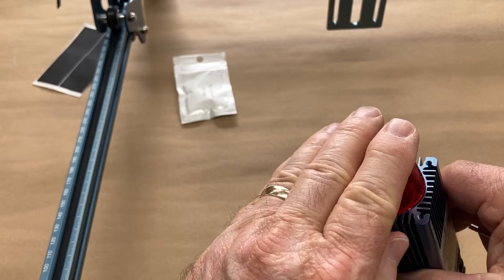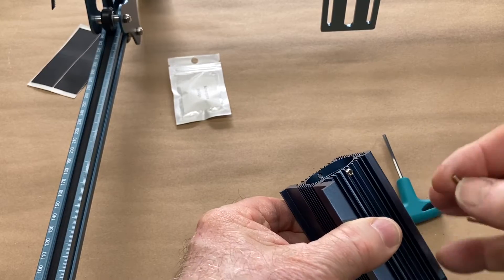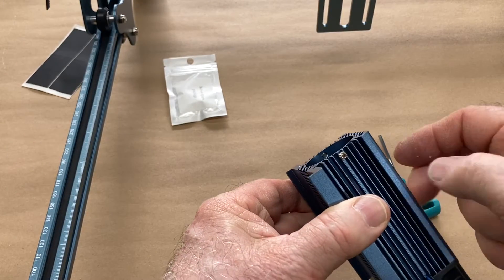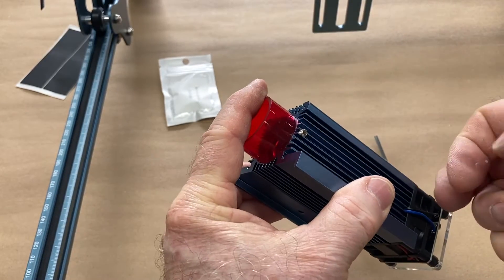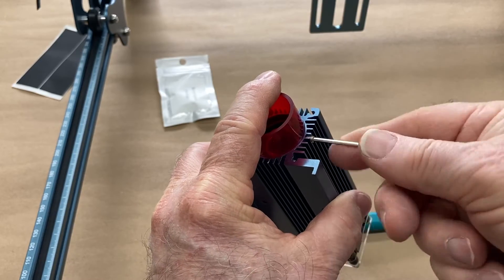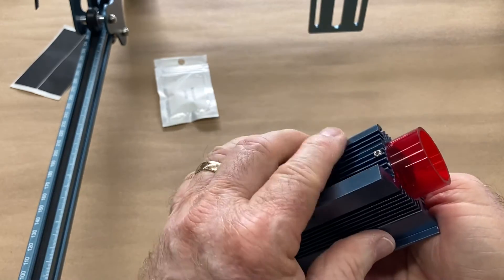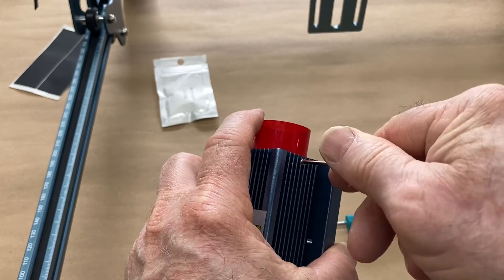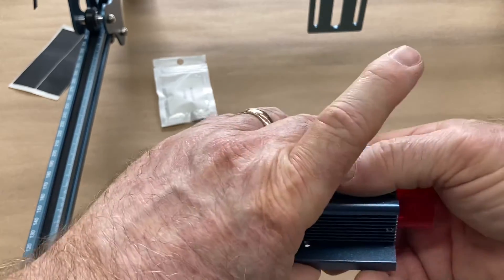On the laser there's a little shield that helps protect your eyes. On each side of it you have two set screws — just open up the set screw, put the shield right down on there, and secure it. The kit also includes a separate spare shield, so should you ever lose one or get one damaged, you have a replacement. I think this is the first laser I've ever received with an extra shield. The two small set screws hold it very well and keep it in place.